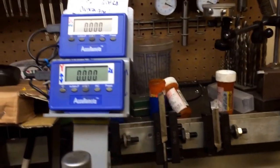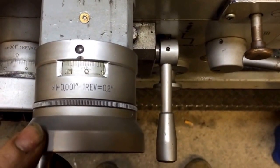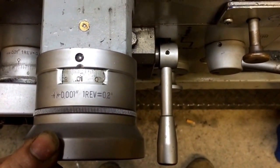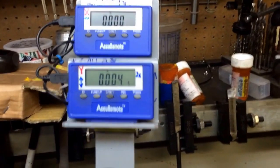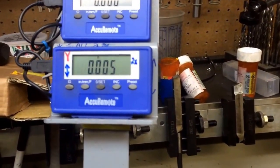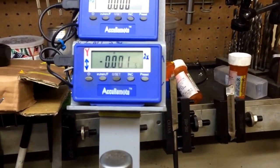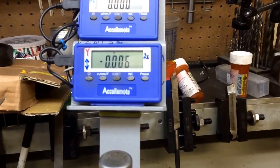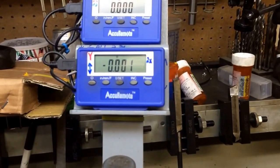The only thing I do not like is this reads exactly how far your cross slide travels, but my dials read half of that — my turn is ten thousandths and my dials are direct read. So it's half of what I turn it. Let's turn this back to zero — it reacts pretty quick. If you're cutting much faster than that, you're doing pretty good anyway.